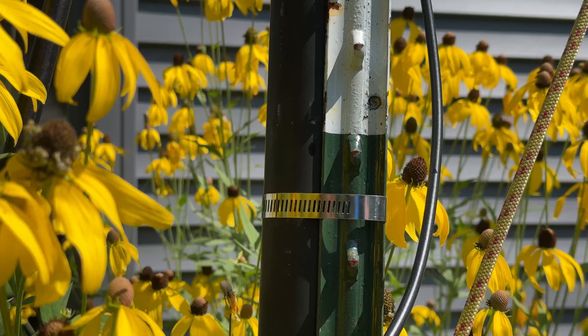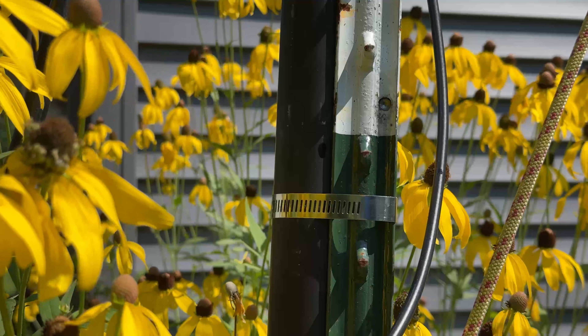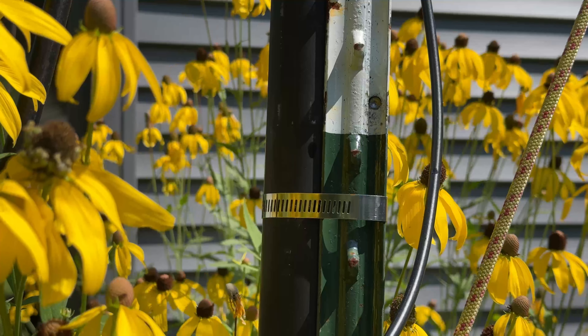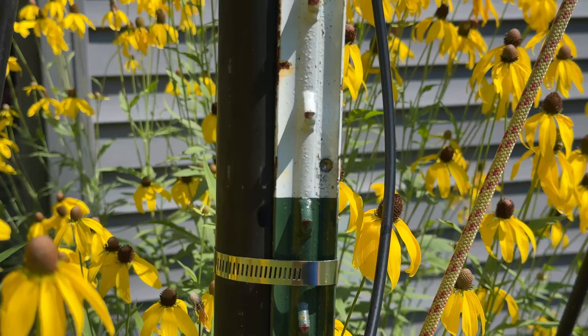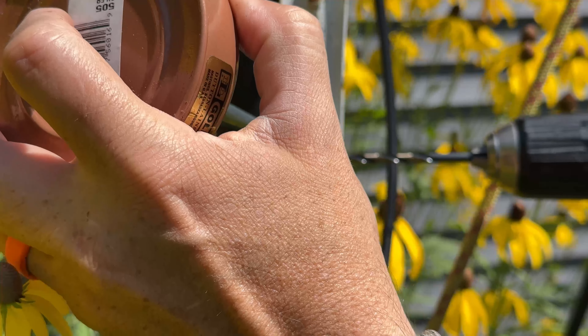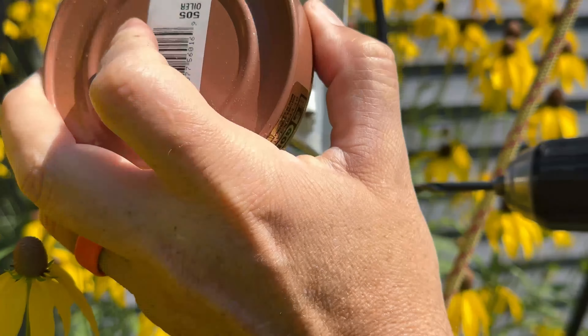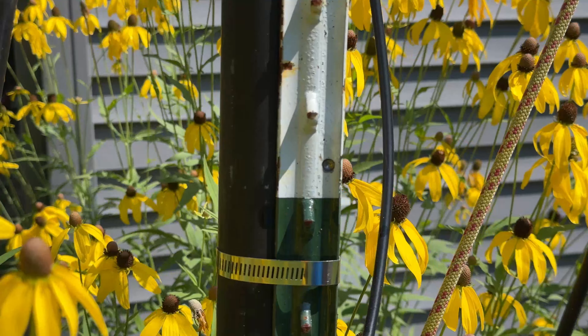I'm not even sure if I recorded any of that, but look, I'm drilling a hole in the... I have a feeling that I have dulled up this bit way too much already. I don't even see a trace of it coming through yet. Let me go find a different bit, hopefully a little bit larger. So I went to the toolbox and got two different drill bits — one smaller and one larger. I'm going to use the smaller one to get this hole going, and instead of burning it out right out of the gate, I'm going to use some cutting oil on it. Drill bits are not going to do the trick today — time to go to the high-speed steel. Today I learned that T-posts are way harder than I thought they were.